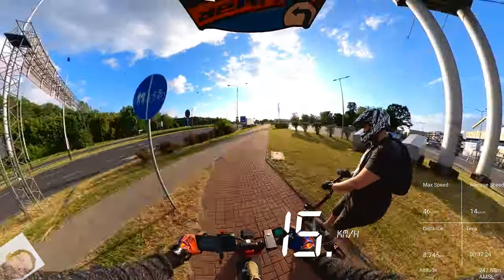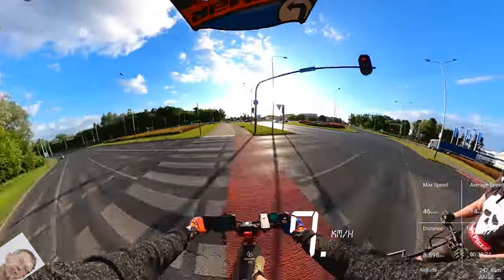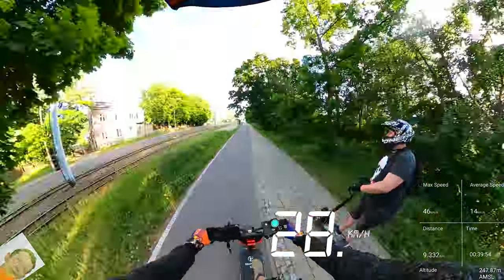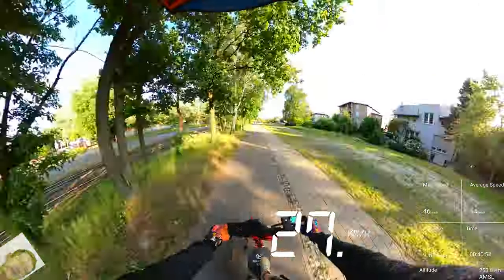If it's truly 30 amps, there are two choices: either the battery pack is bigger than 30 amps, which is highly possible, or the second option is that the controllers are super efficient, like they are using a FOC system or something like that.